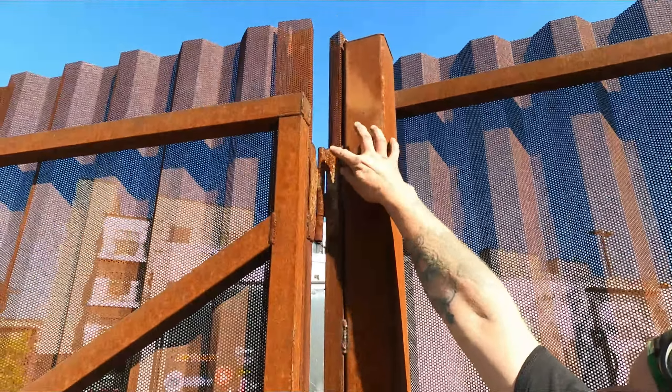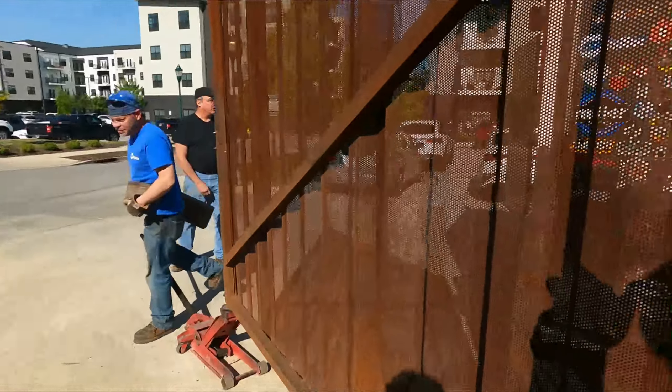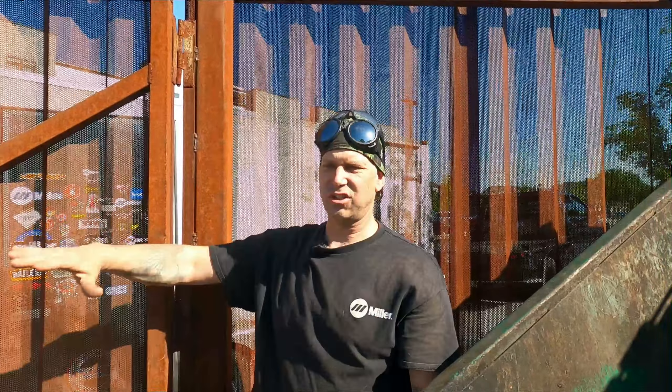That's what we're going to be working on today — get these gates off, put the gates together as one gate. That's going to be a lot easier to get it in position, make sure everything's held together and level on both sides of the barn gates. Stay tuned — that's what we're working on today. Step one, we're going to come through here, slice slice slice, we've got a jack out there holding the weight.